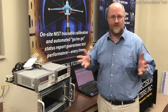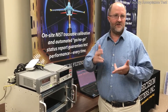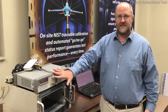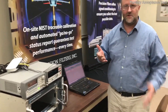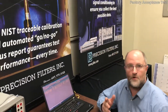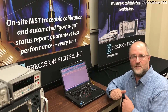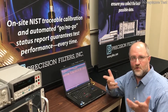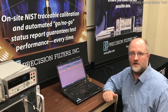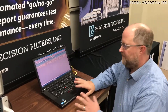When we run our factory acceptance test — or as we call it, FAT — we verify every single function of the card: excitation, filters, amplifiers, etc. These are the components of the test system. The actual FAT calibration test runs out of our GUI program. Our GUI program comes with the system; it's a graphical user interface that provides access to all the functions of the card so you can program all the hardware settings, and from this GUI program we can also execute the factory acceptance test.